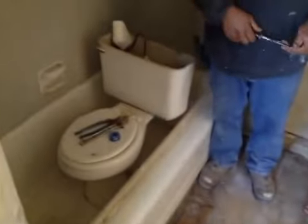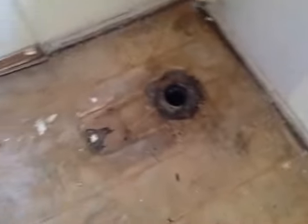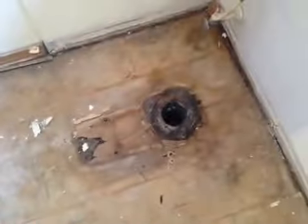Why is there a toilet in the tub? We can't have it installed — we just move the toilet. Oh, that's where the toilet is going to be? It looks like water damage. The wax ring was loose, the toilet was loose, and every time we flushed it a little bit of water would come out. So there's no big problem — not a big deal.